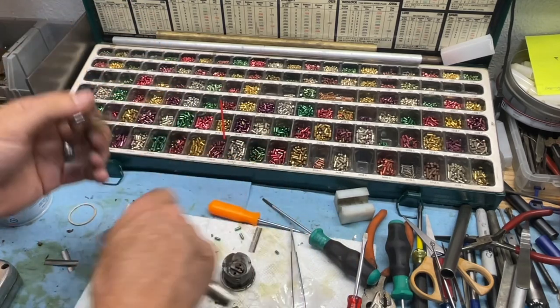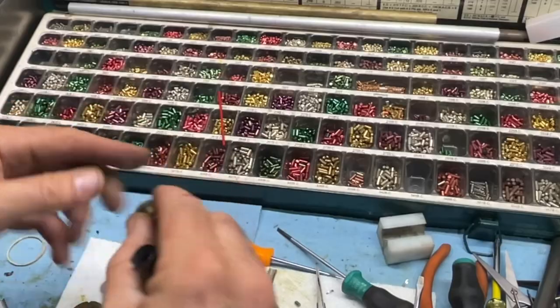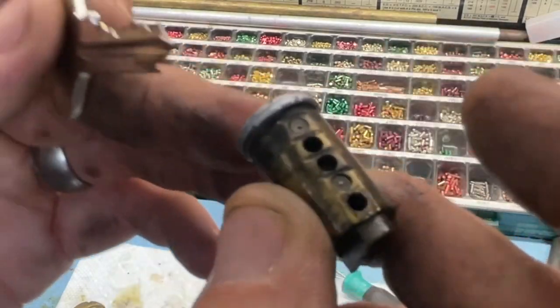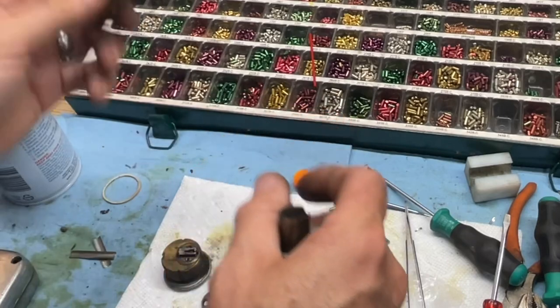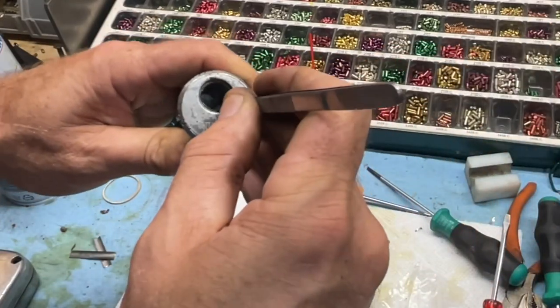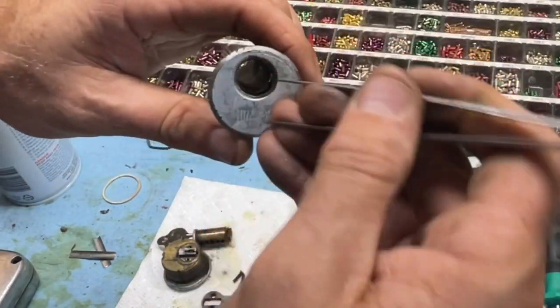Okay, well, that's it, y'all. I mean, really, it's just a standard mortise rekey. Oh, that's some rough stuff right there. That's how they did it back in the day. So, go ahead and check our top pins on this one. Oh, yep, we do have a booger up right there, so that's why you check top pins.